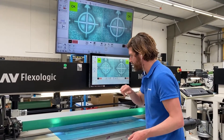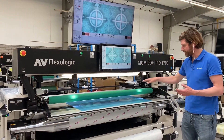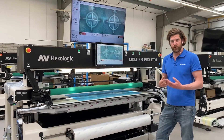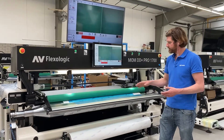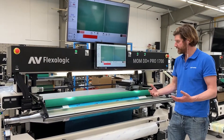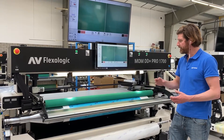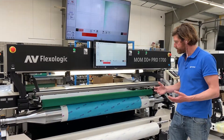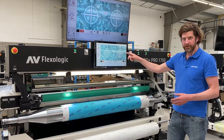I say 'go to mount' — and that's the second option. A vacuum system comes on which holds the back of the plate. There's a nice open-cell pressure roller which does the work of applying the plate to the sleeve while the sleeve is rotating. The front table is also motorized, helping to assist the operator to hold the top part of the plate. It rotates in two directions. When the mounting process is done, after the last plate, the table comes up, the pressure roller comes up, and it does an automatic quality check.